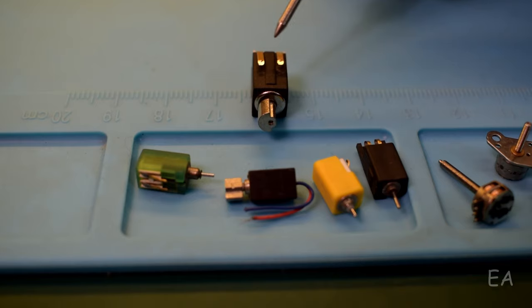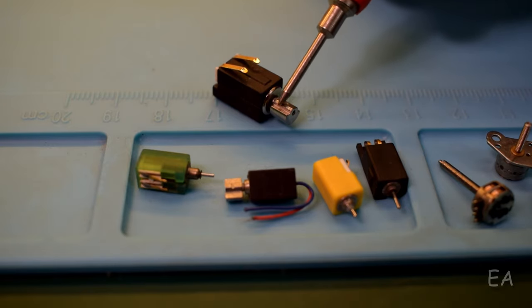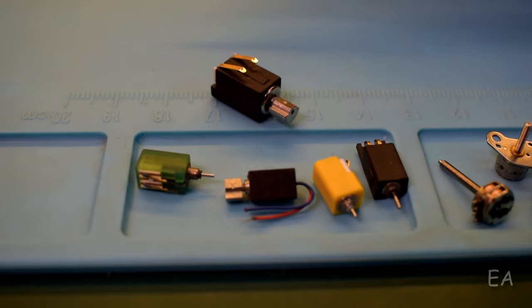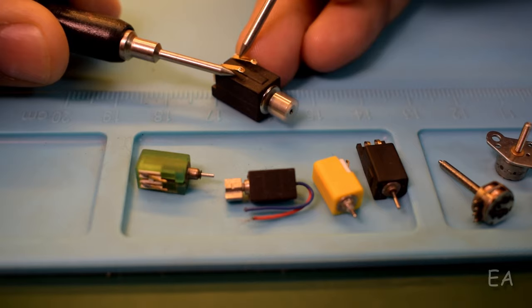You might have seen these motors at some point in your life, as these are commonly found in mobile phones and other mobile devices to generate vibrations. This is nothing but just a DC motor connected with an imbalanced load to its shaft, and when some voltage is applied across its terminals, it generates vibrations. So you can apply 1-3 volts across its terminals and it will start rotating and thus generating vibrations.